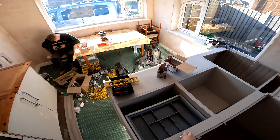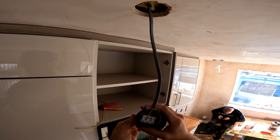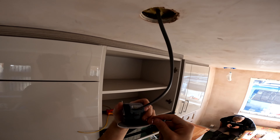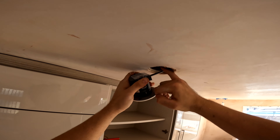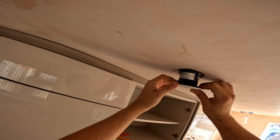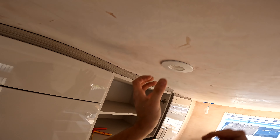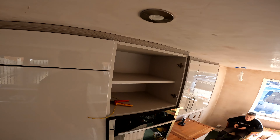Then there's a little plastic cover that goes on. Easy as that. Pick your colour setting — we'll go warm white, I think they wanted warm white. Check for wood to make sure the springs aren't going to land on the wood. That snaps up nicely with a little magnetic bezel. Jobs a good one.